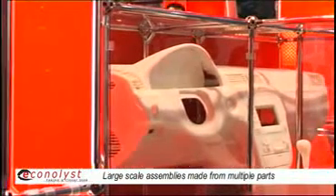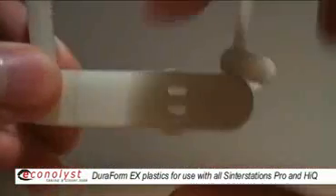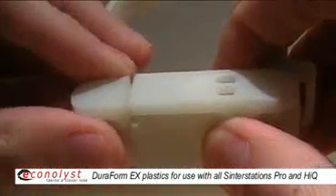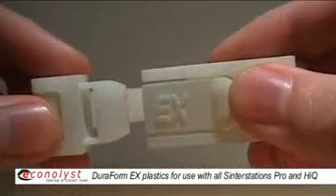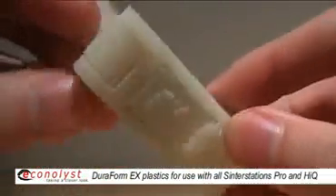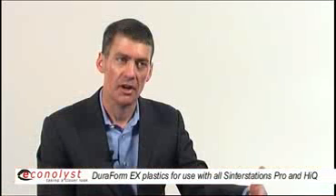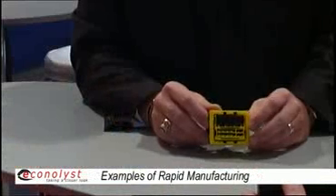This has made it a very transparent transition for manufacturers in that particular case. We also have a newer material called Duraform EX, which is a next-generation polyamide system. It has enhanced toughness compared to the earlier-generation Duraform systems, and in fact has elongation at failure and unnotched and notched Izod values which are actually as good as or exceed molded parts made from polypropylene and ABS engineering plastics.